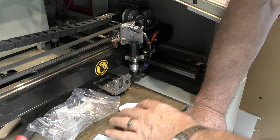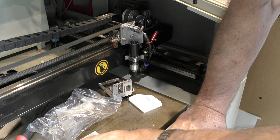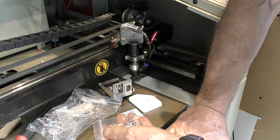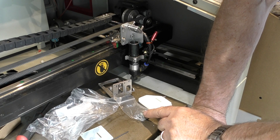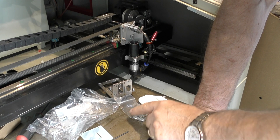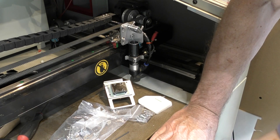This kit contains everything that you need for mounting it onto a China blue machine. For modifying the bracket if you want to fit this head onto an existing Cloudray bracket that you may already have, there's a jig for modifying the bracket. There's a pack of screws here with springs for making the adjustable number two mirror system that I did for the China blue machine. These two pieces go together if you wish to make a new bracket, which I suggest you'd be well advised to do, because the Y adjustment on the China blue machine is difficult — every time you adjust it you're going to have to reset the X. Whereas with this new system which controls the movement of Y, you won't have to keep resetting X. Choice is yours.